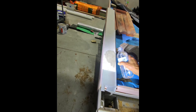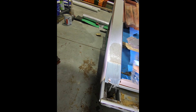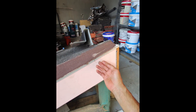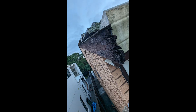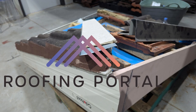The Z flashing actually provides two benefits. First, the little hook that's buried under the tile roof will catch any water that runs inwards towards the roof and drain it out into the gutter. The other advantage is that the other leg of the Z actually covers a little bit of the top edge of the fascia, which prevents moisture from getting to the top of the fascia and causing rotting of the fascia timber. That's the reason why we use Z flashings whenever we bed and point a gable — it shows that we can innovate and make positive progress in the roofing industry.